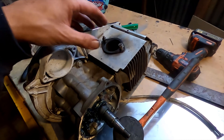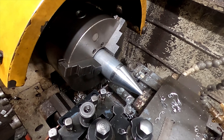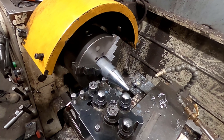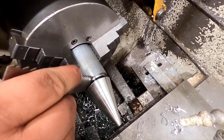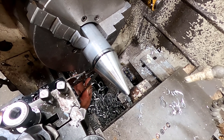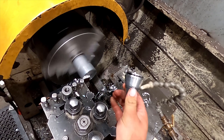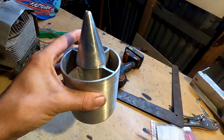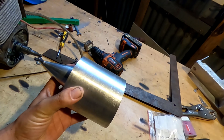It's a 210cc motor engine. Joel's helping sort out the part that goes inside the back bit because he can't machine it once I've cut that cone off, so he's just going to bore a slot for the o-ring. Joel's just made a groove for the o-ring and stuck it on there. We can't get it back out anyway — we'll figure it out, we have the technology. We're going to part it off. There's that thing shoved in there. The bolt will go in and hold it all together, and no water can get in.